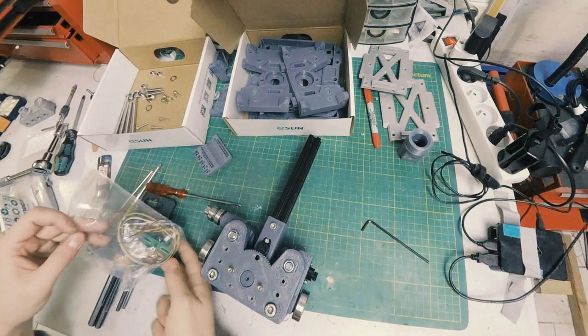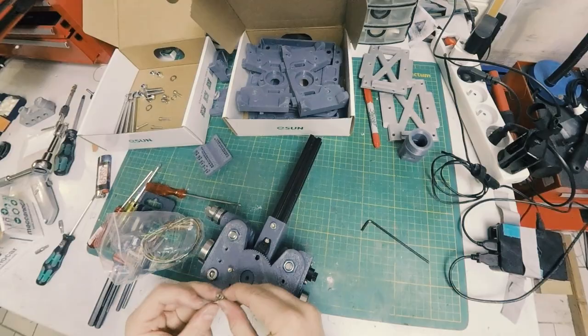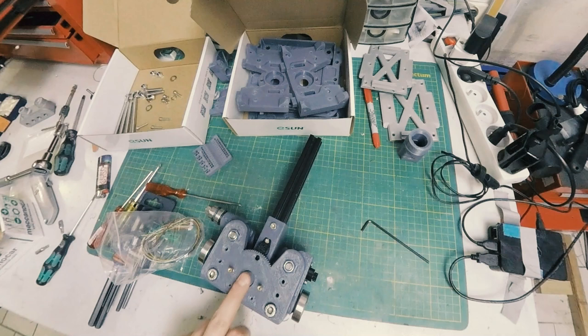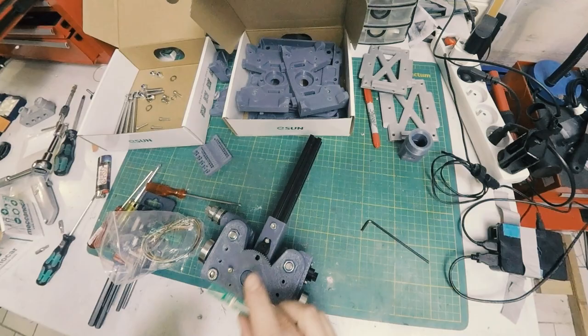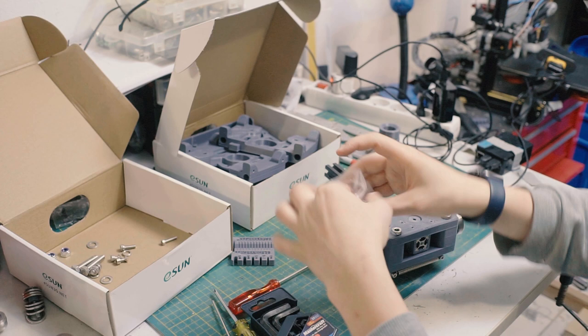Oh, and the important thing too is these little magnets it comes with, which I'm not going to glue in right now because I don't want to glue anything until I've got all the electrical figured out, the whole plan set up. But basically, that little magnet, you find its north direction, or north or south, just its axis this way, you stick it in there, and you glue it. Just put a little dab of super glue. And then that sits there, and then you put the screws in there, and you can adjust it for centering. And that's how the axis sensors will work. But for now, we're not installing them, we're just focused on the mechanical.